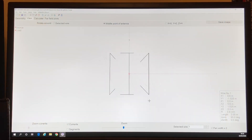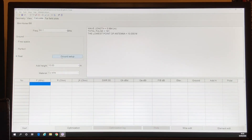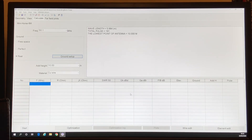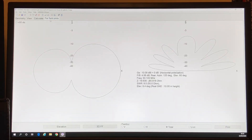I've also been getting into using MMANA-GAL antenna modeling software, so I entered the dimensions of the six meter mini-horse and calculated the far field plots. At 10 meters height it comes out at 8.2 dBi, which is 6 dB at five degrees elevation - where the lower DX will be - and 10.1 dBi, which is 8 dB at around eight degrees elevation.